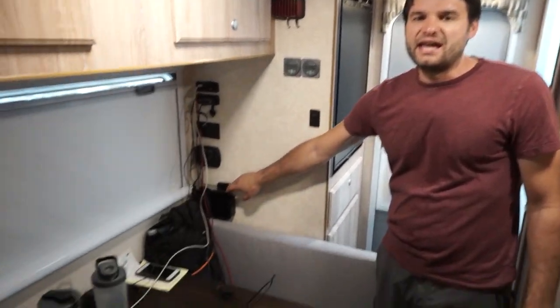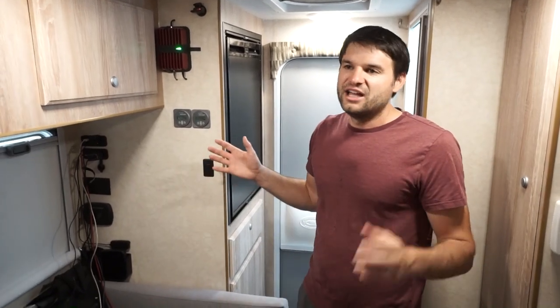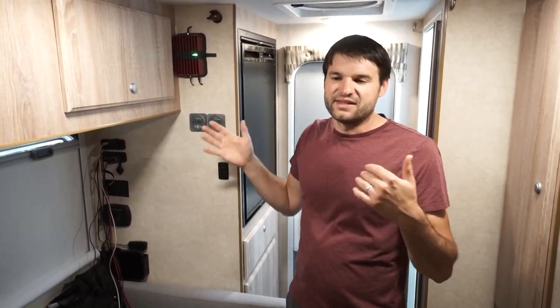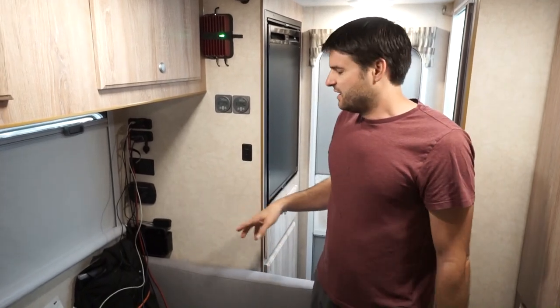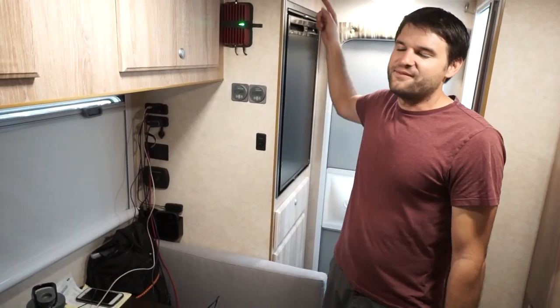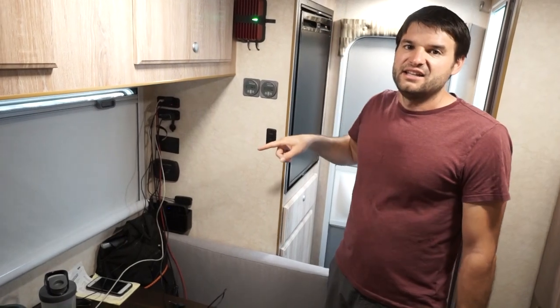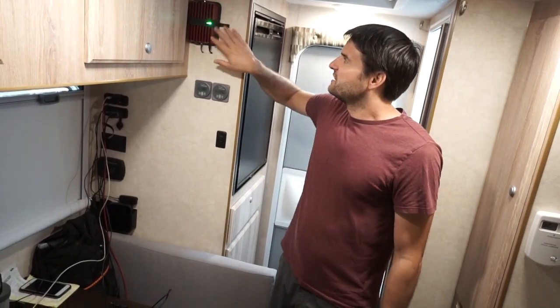This certainly isn't going to be a 2 feet or 3 feet style booster for your vehicle. They do offer kind of a desktop antenna, which gives you a bit more range. I think people were saying you get a foot or so, possibly more. But one of the problems with the internal antenna is it can't have too much power because it interferes with the outside antenna, and it gets kind of this reverb type of effect where it's picking up on itself and doing nothing for you. So that's worked really well for our camper because realistically our camper is really small and we can't have that much antenna separation from the outside antenna to the inside antenna, unlike our Winnebago View, which was much larger and we could separate those a lot further. So this has worked out pretty well.